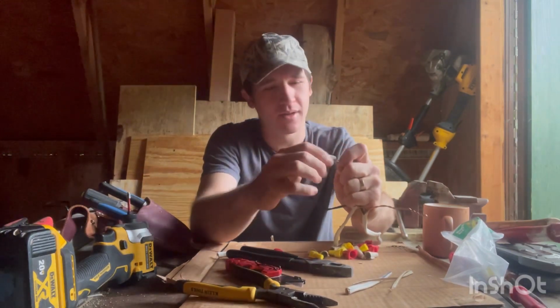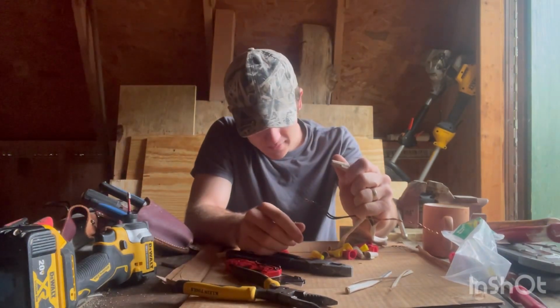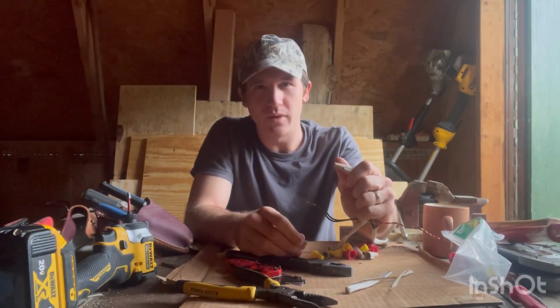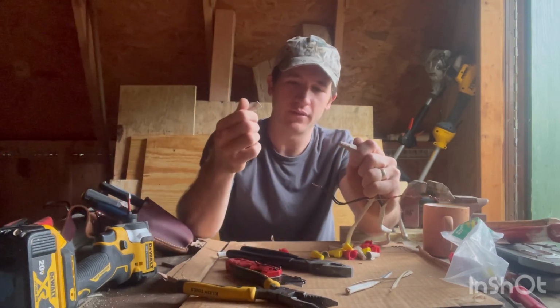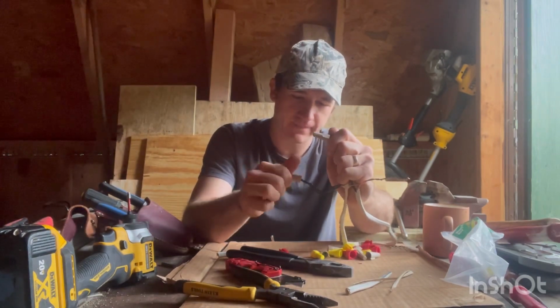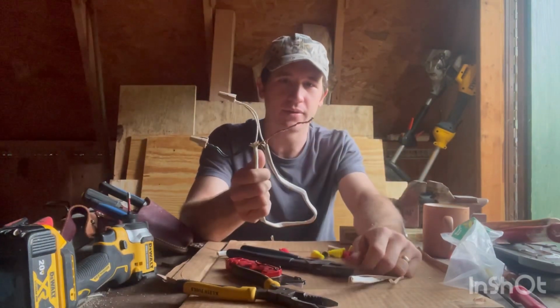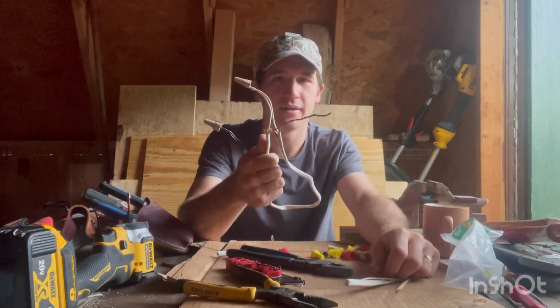I mean, of course, you don't want to have two number 6 wires under a tan. That just wouldn't make sense. But with a 14, you could use a yellow or a tan, 2 of them. Twist them up. Again, no need to twist that. That's already making a good connection. There's no danger in that. And so that's it.